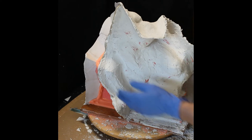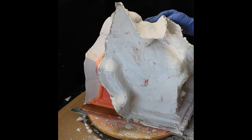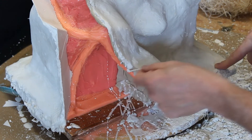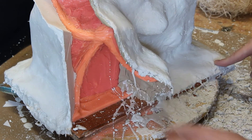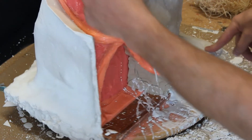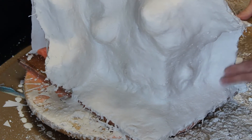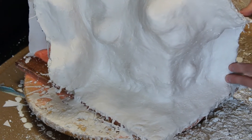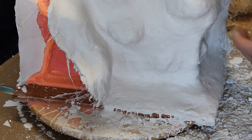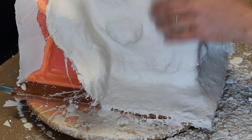When it starts to kick I can slather it on and really start to smooth it out so it looks more like this. Stuff like this isn't a big deal — we can go back and clean it up after it dries. Don't do it while it's wet or you'll smear it, but once it dries you can chip it right off. Some areas I didn't get as thick as I wanted before the plaster set, so I can go back and add more. I want to make sure I hydrate it well before covering up those areas.